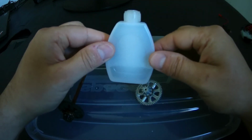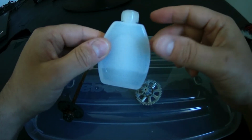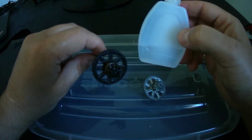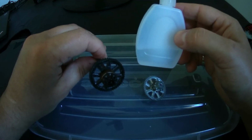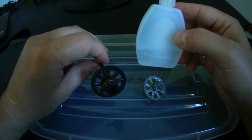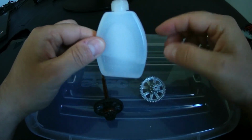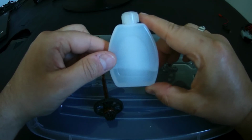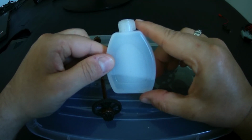And when water gets into your toys, for example, if you try to dry it and you have a lot of grease in it, the grease forms a lot of spaces and pockets where water can stay, and the warm air doesn't get into those spaces, so water stays inside. But the oil is more liquid, it can flow, so it can flow with water. You can easily dry all the parts which have oil and water together.